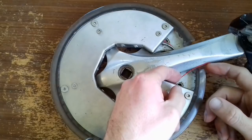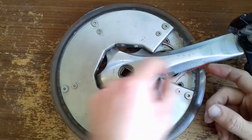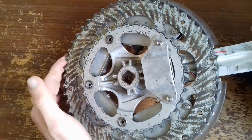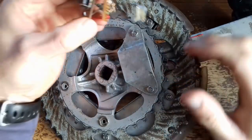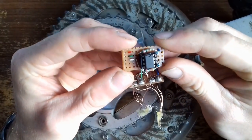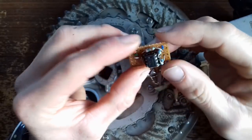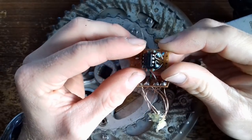Here is the NRF24L01 module antenna extension, which I put on and which seems to work fine — half of it's within the housing. Going around to the other side, under here is the amplifier. This is one here, which I used as a test one. It's based on an LF353 amplifier. I don't really know much about them — I just set up the resistors to give the right gain, which I believe is around 3000.